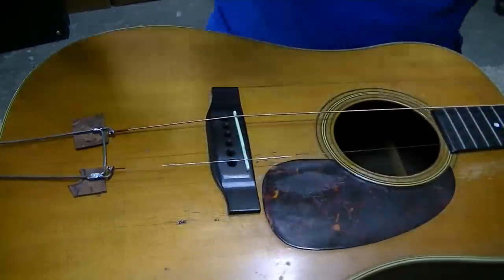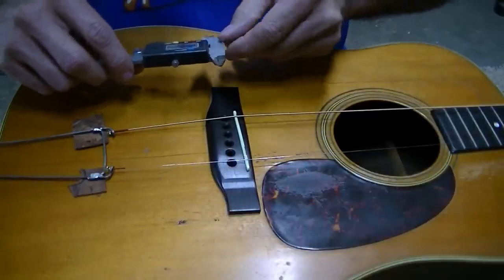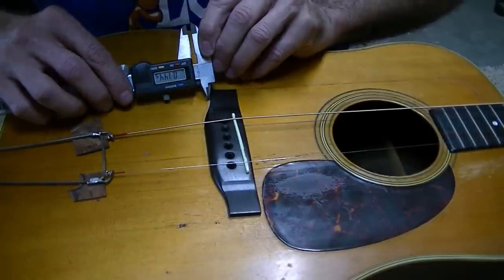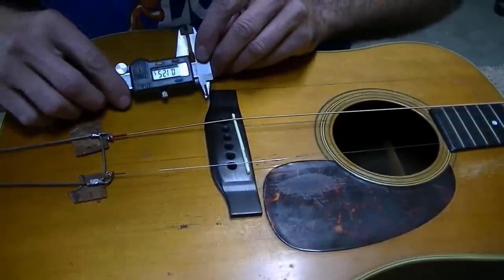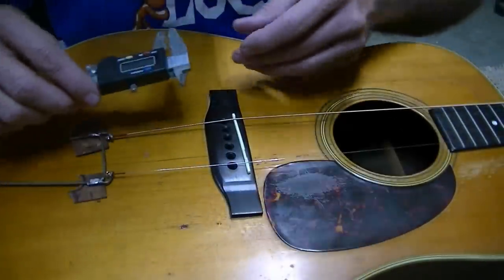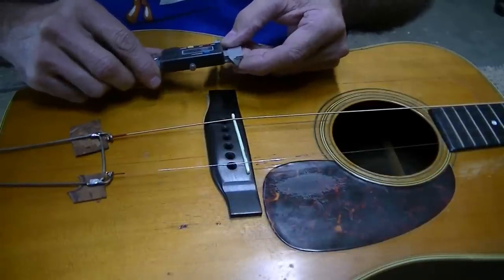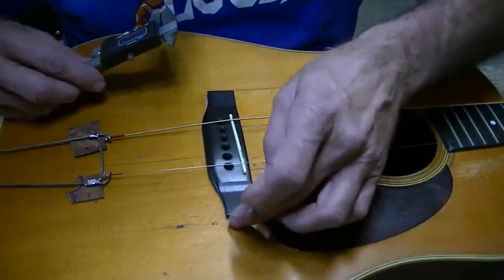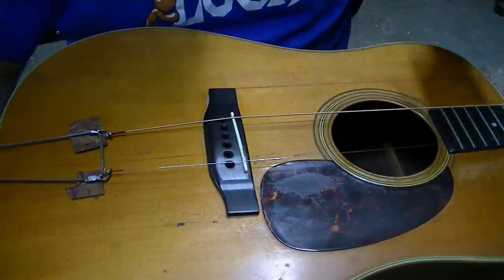The question is how much bigger. I'm going to measure and see. I'm going to put the calipers on an eighth of an inch — that looks pretty close to what we've got here. I'm just going to make it 120 thousandths bigger all the way around. That's just five thousandths less than an eighth of an inch. We'll use this one as a pattern — draw the straight line across here, then move it 120 thousandths across the front and draw the back. That's how simple it is.